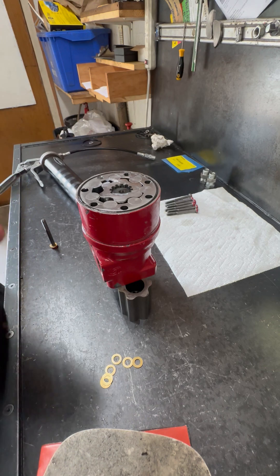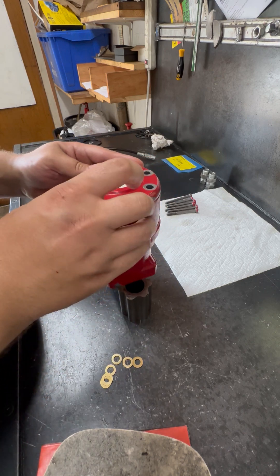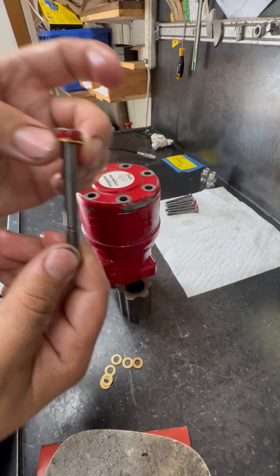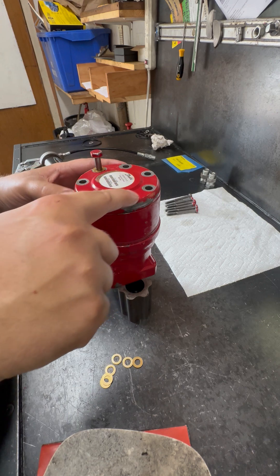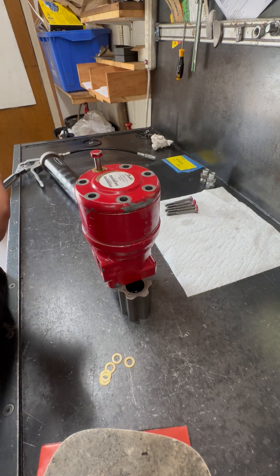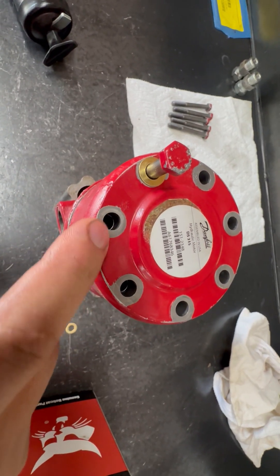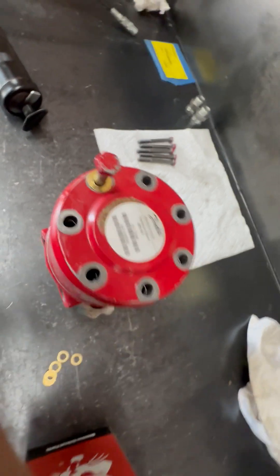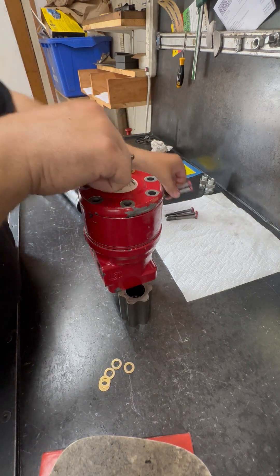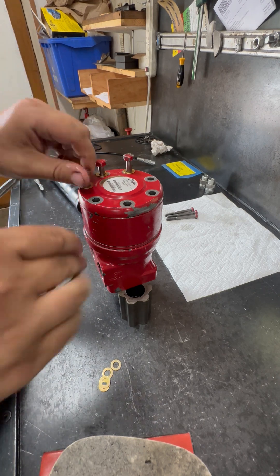Here is the back side of our cover and we're pretty much going to put it on, just like that. Then we're going to get our new washers on here, because these are again wet. Make sure the surface where the bolts and washers go into are clean — no paint obstructions. This surface is very clean, white steel, not rusty, because it will leak and cause a failure in the motor. So we're just going to put on our bolts, look at spec off camera, test it, make sure it spins the correct way. That is the assembly for a DS Danfoss motor.